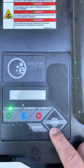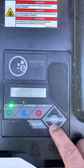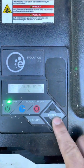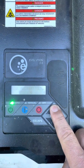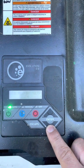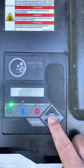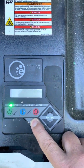Then under 'utility recovery volts' — this is the voltage at which your generator will turn back off once you hit this level. I've reset mine to 216 because that's as high as you can go. It was at 190, which is exactly what I was measuring when it would turn off at my panel, and that's too low — my appliances didn't care for that. So I've reset mine to 216. There are other things you can change in here, but for the purpose of this video, that's not what we're after.